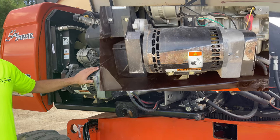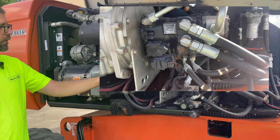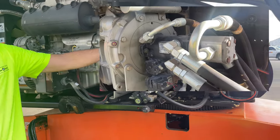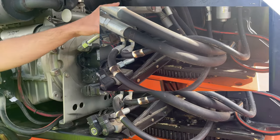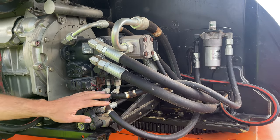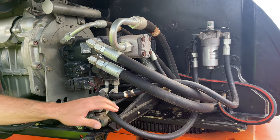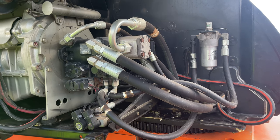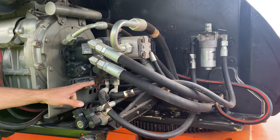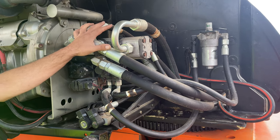These generators like to fall off — inspect the bolts, take a quick look. Is it falling off? We have harnesses and hoses underneath here — make sure nothing is falling off or frayed. When it comes to the pumps, we have function pumps and all the plumbing that goes to them. For hose inspection, look for any exposed steel braiding. Minor rubber cracking is probably acceptable, but if the steel is exposed, rusted, or has broken strands, replace that hose. And obviously if it's leaking, it must be replaced. This pump is actually very dry and clean, so it passes — I'm okay to operate this.